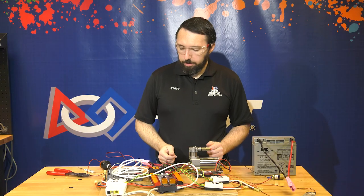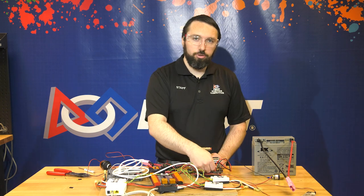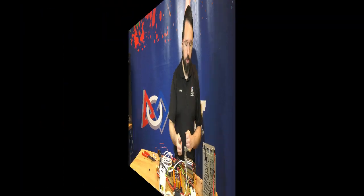We have now completed our CAN chain from the RoboRIO through our motor controllers to our pneumatics hub — which you can bypass if you're not using pneumatics. That completes wiring the basic pneumatic system. For help wiring the rest of the control system, check out the companion video in the description or the step-by-step instructions on the WPILib documentation website. For help plumbing the pneumatic system, check out the pneumatics guide on the technical resources page. Thanks, and see you at the competitions!